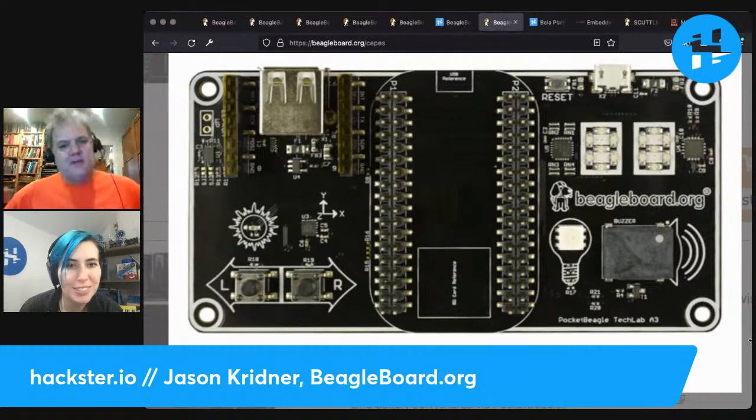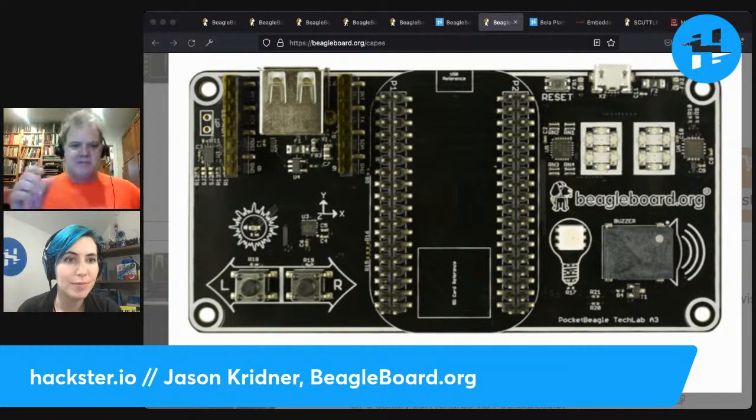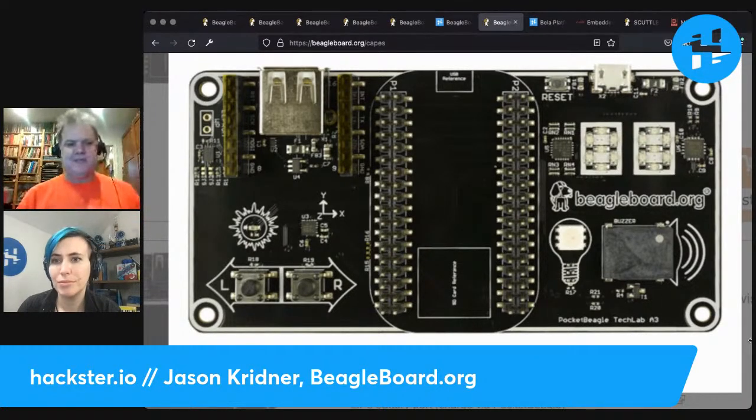And you've got the analog for the light sensor, right? Because it's nicer to do something solid state. I love potentiometers, but to play with the analog, this one we use the light sensor just to try to make it a little more solid state. Still got the push buttons, but anyway. Potentiometer was a little bit of a hassle. I2C, we use the accelerometer that's on there. For PWMs, we get to use 3 different PWM channels for the RGB LED.